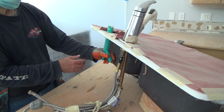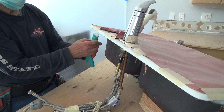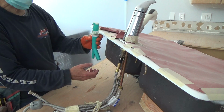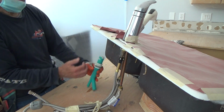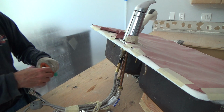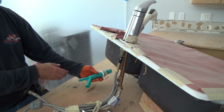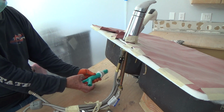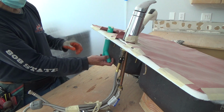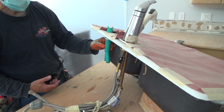So, you know, the trick is, if you've got your aerator on there or off, whatever, and you're replacing your other pipes, let's say, just take your top nut off, slide it down, then you can have this down at the bottom of your cabinet, and then you can take the things off. And then you can measure your new pipes and everything, put everything back down low, okay? Then push everything back up. If you want, you can put this in and just tighten it a little bit and just leave it dangle. Don't do it for good.